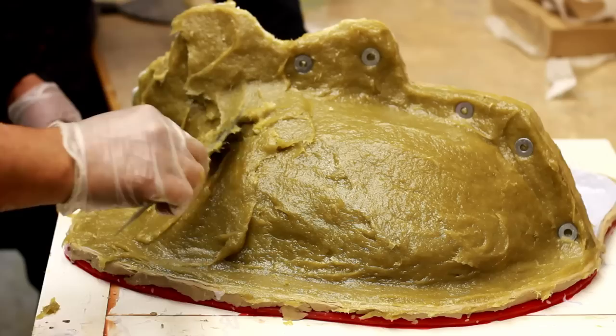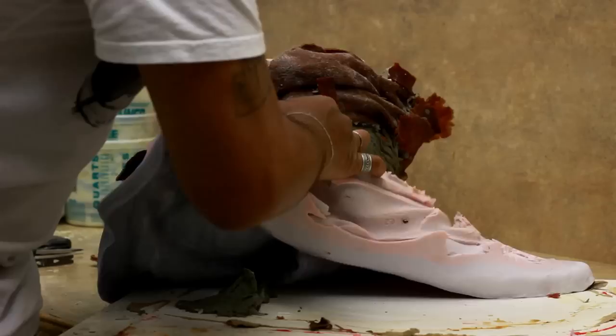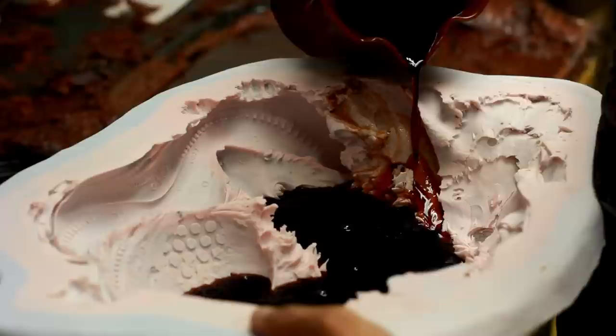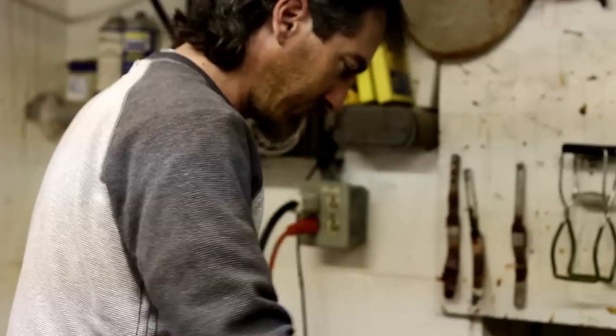You put the mother mold, and after you're done with that, you open your mold, separate it, and take the original clay out. Then you close the mold back and you're ready to pour the wax. You pour wax inside the mold and rotate it to coat it well — really hot at first. The first coat is hotter and applied slowly so it doesn't trap air bubbles. You pour it back into the pot, let it cool down 10–15 minutes, and repeat for three to four coats until it builds up to about less than a quarter inch thick.